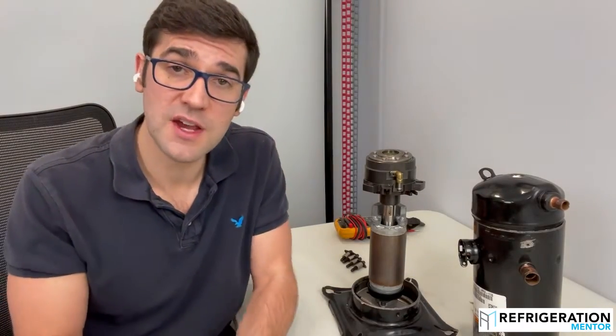There are so many different types of compressors out there, different brands — semi-hermetics, hermetics, scrolls. Scrolls are a hermetic compressor, but understanding the different internals is so important. This compressor is going to trip off differently or have different internal protectors than another scroll. Copeland makes over 20 different types of scrolls — different capacities, sizes, and internals. So you need to understand, when a compressor fails, what caused that failure.